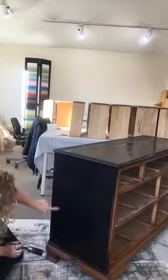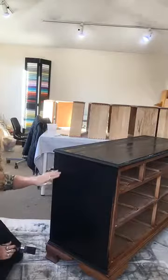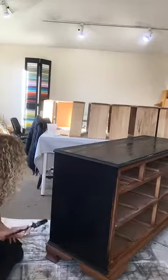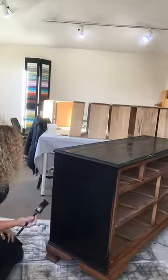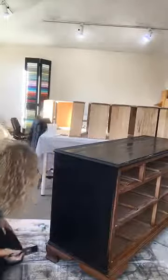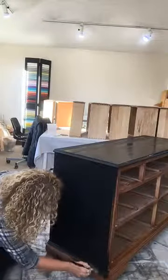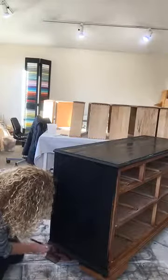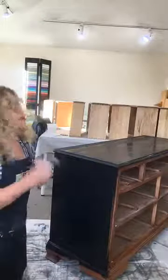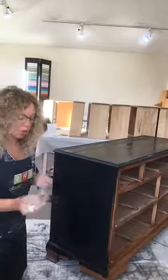As you can see, there's still a little bit of streaking, but that will all be covered up with the second coat. You're going to get that usually with the first coat — you're not going to get perfect coverage. So that looks pretty good, and then you would just continue the same technique all the way around. The better the brush, the better the finish. Get it on and then do nice, long, even, light strokes to smooth it all out.